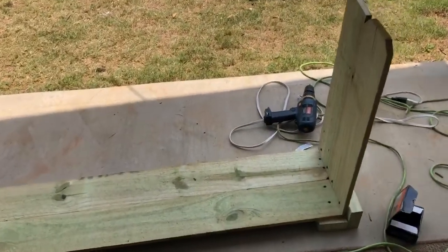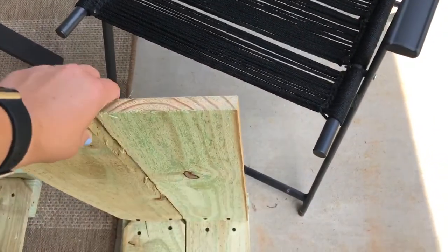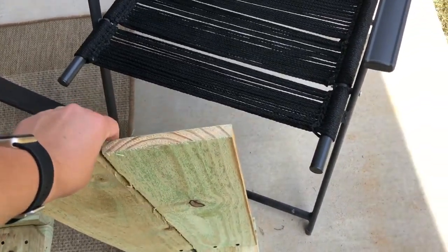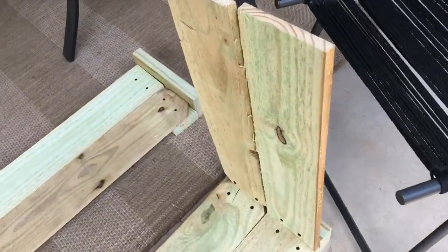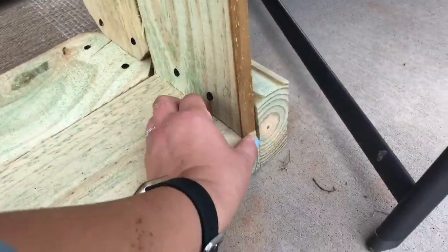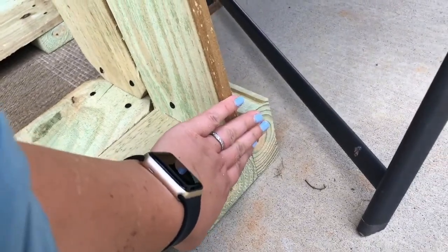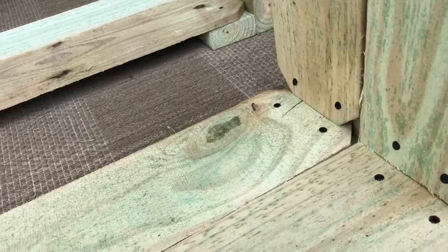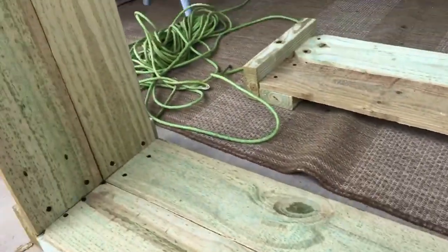So it's pretty much done. I did the sides. This is how I do the sides with these, just because sometimes they can be a little warped because these are like fencing planks. What I do is I align them with the top first, so these are nice and seamless, because this is what's going to be shown at the top. Bottom, I don't really care if it's a little bit uneven. Sometimes it ends up being uneven, but it's pretty sturdy this size.